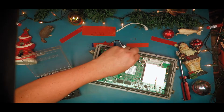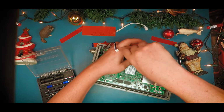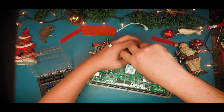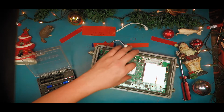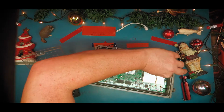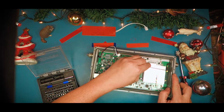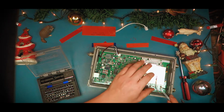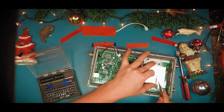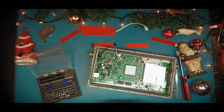Here we go. We've got, I saw one more, there's one more cap stand right here. So this whole thing is heatsink, of course. Hence why the actual heater was mounted against the internal heatsink there. Let's disconnect these guys. I need my little tweezers here. We're gonna just get underneath there and just carefully pop it like so. This guy here, it's got some hot glue over it, so there we go. Always be very careful when you take these RF connectors off.